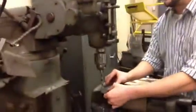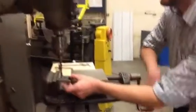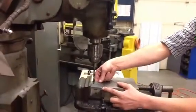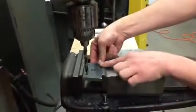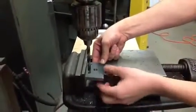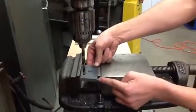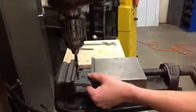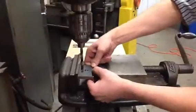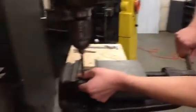I'm also not using parallel bars here. What I'm going to be doing is leaving my plate hanging off far enough out of the vise, but still enough inside the vise that it's secured. I'm doing that because when we zero out our drill, we need to have a material to touch off and zero out. I'm going to secure this in the vise very parallel, using my fingers to make sure that I'm flush with the top of it.